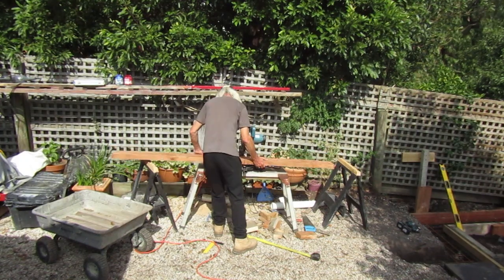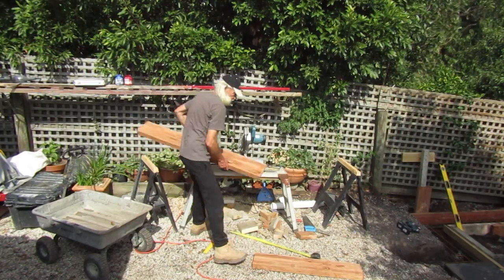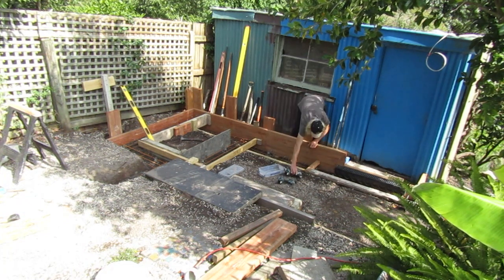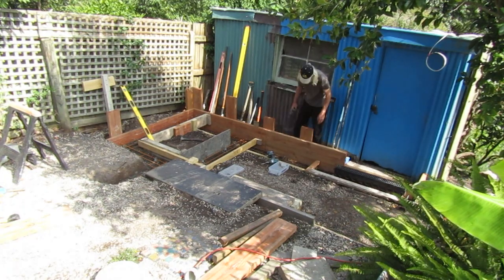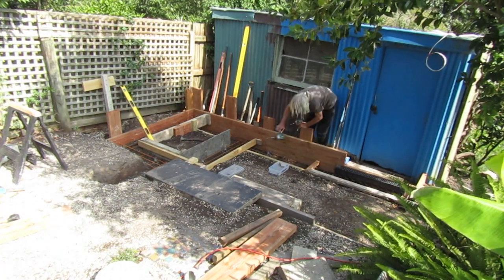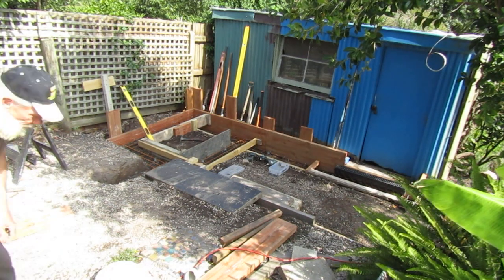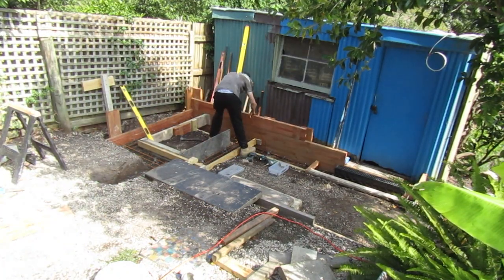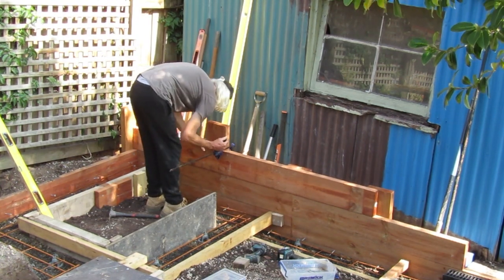With all the vertical piers complete, we moved on to the horizontal pieces we need to install. We cut our horizontal pieces so they end up on a halfway point on our piers for strength and looks. We always crown our timber so we can see which way the timber's bending. This way we can make the most of the natural bend in the wood and have a nice tight wall.